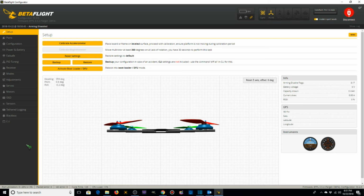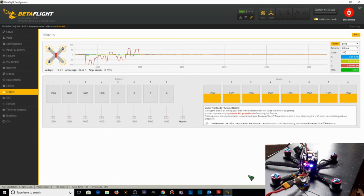Then you've got one on the shelf ready to put back in. Okay, I've got good news. I think I've found the problem for motor number 2 not spinning. In my attempt to keep the flight stack as low as possible in height, it was actually too low, and the bottom of the ESC was touching the battery strap and/or the carbon plate of the main frame.